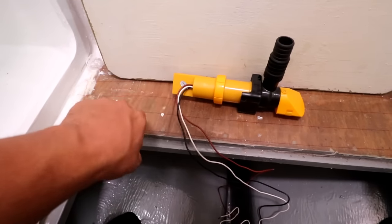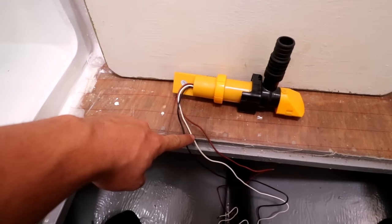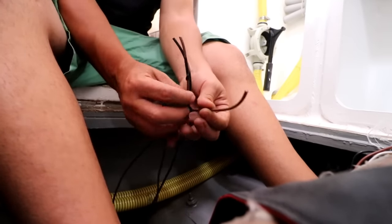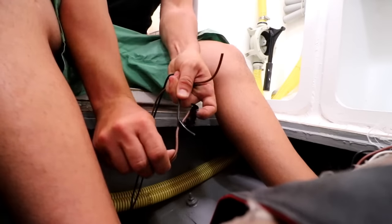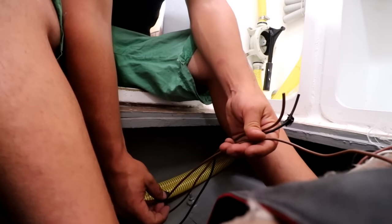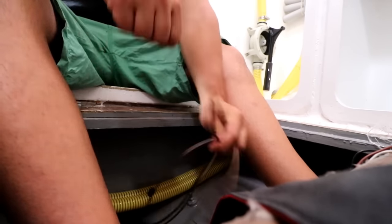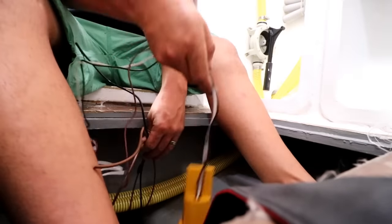That's how I mark the wires — positive, negative, and that would be the bypass wire. I'm going to keep them marked like that. All I gotta do is keep one piece of tape on the positive and I'll take that tape off later. The negative I don't need to mark because there's only one negative. So check the length out, start dropping it into the hole, because the less wire the less voltage drop and less unnecessary resistance. All the way nicely to the bottom — leave always a little bit of extra, not too much, and then cut off the excess.